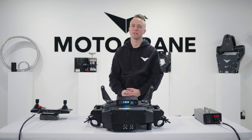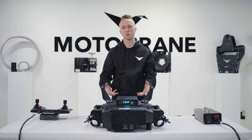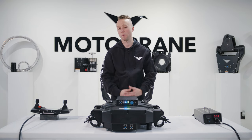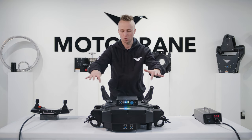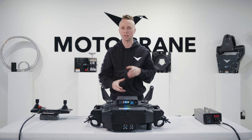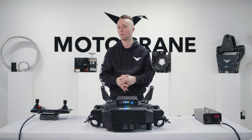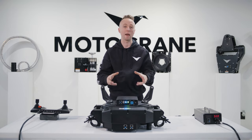The XP base has also been designed to much higher standards of stiffness and rigidity, which allows it to serve as a much more robust platform for the rest of Ultra to perform on. Integral to that stiffness and rigidity is a large diameter cross roller bearing that the base pedestal operates on. Cross roller bearings are used in applications where there can be absolutely no play or flex between the inner and the outer race — making it perfect for this application where we demand that stiffness.